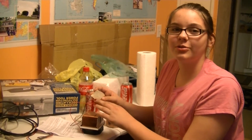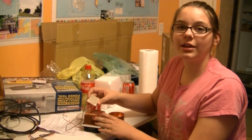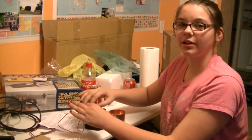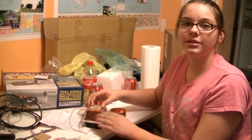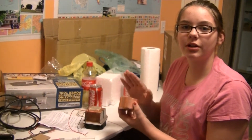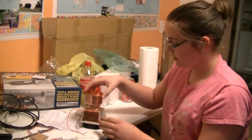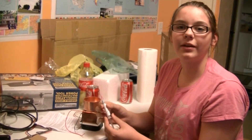This is the thermoelectric cooler and we want the heat going away into this copper heat sink. There's a hot side and a cool side. We have to put the hot side on the copper heat sink to get the heat away, and the cold side on the two and a half inch copper pipe cap to get it to the can. To do that we're going to use this thermal paste.